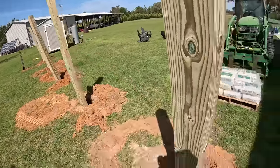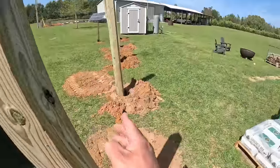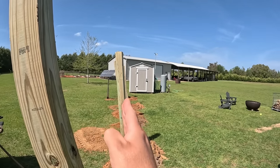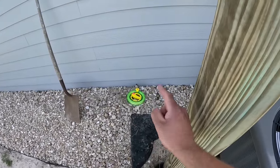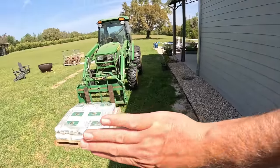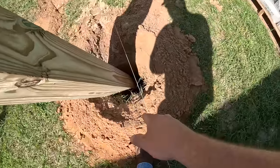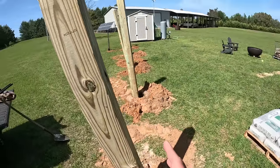I have all my posts but one set on this side. You can see where I've pulled this string — it lines up with a post that supports the corner of the shed, because I purposely squared off the shed for this fence. I've got a rebar stake that my string line goes to, so I know this direction the fence is nice and squared up with the front porch of the house. My holes are roughly 40 inches deep, which is a bit overkill, but we're trying to make a very strong fence here.